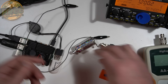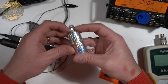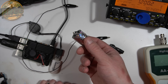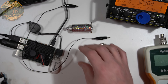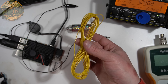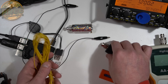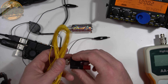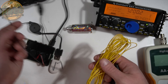I pre-cut and took a shot in the dark. I thought, what would this be resonant on? I guessed maybe semi-resonant on 20 meters, so I grabbed a small coil of wire that happens to be cut as a 20-meter radial. That will connect to the other side of the antenna off this binding post and go into my KX2.